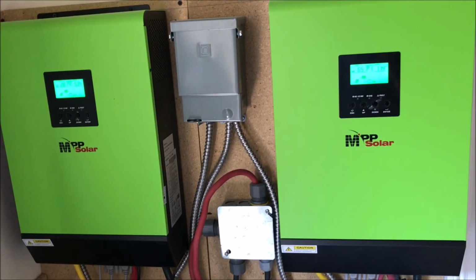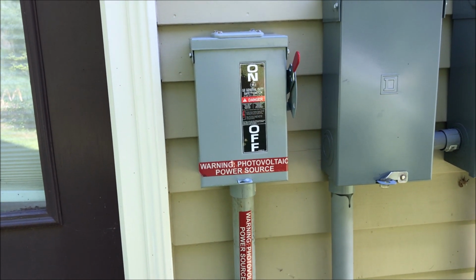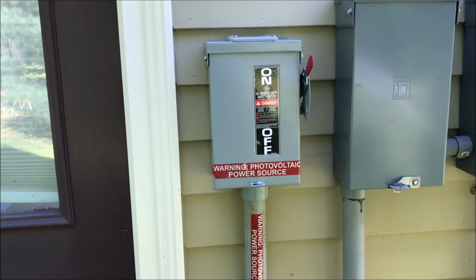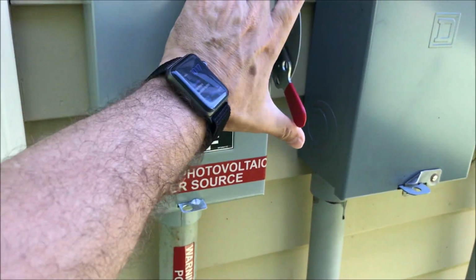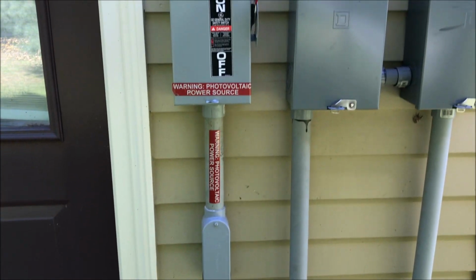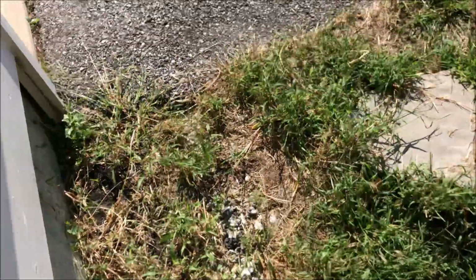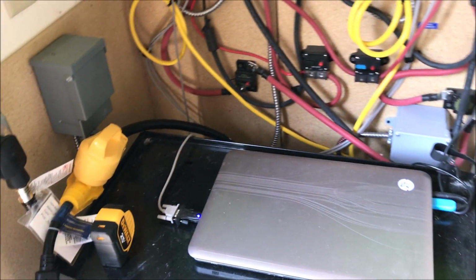In order to do that, I had different requirements. The first is to have a shut-off switch for PV. Basically, this will disconnect the system from the AC that is connected to the grid. So if a technician comes outside to work on something, they can just come, shut this off, and basically my system is off grid and has no ability to connect to the grid. That was the deal. And also to have stickers that will basically say which lines are PV lines. So you can see that line here has a sticker PV line and goes all the way to where it's actually connected to the grid, including the switches themselves.